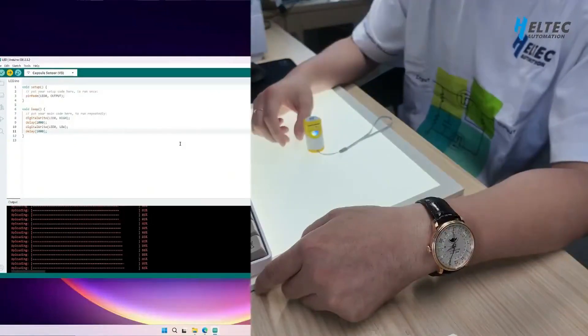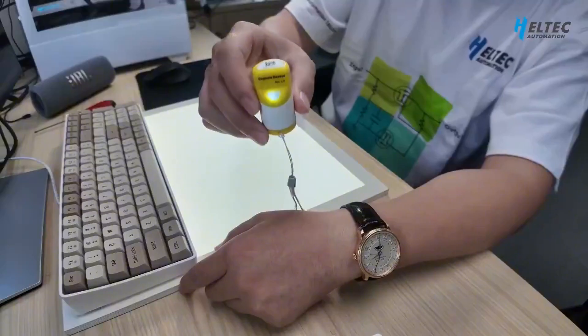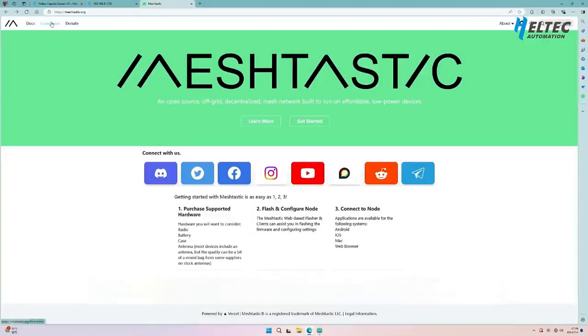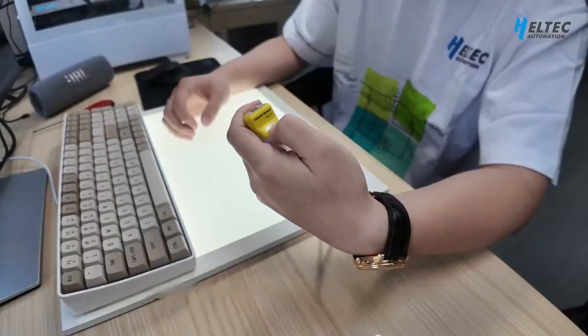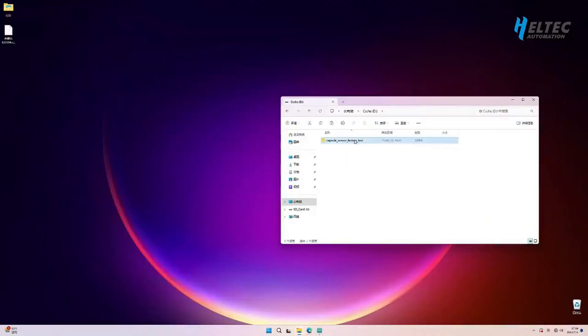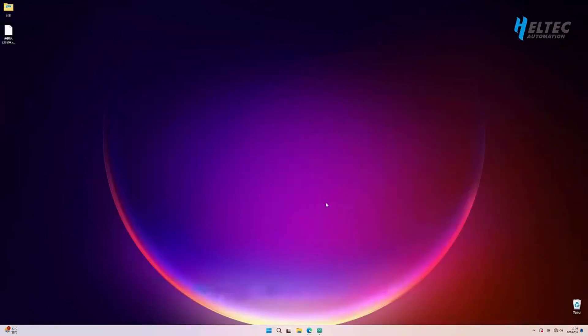Write a bit of code to make the LED blink in the development environment. Select the mode and you will find the wireless boot IP under ports. When uploading, you will need a password which is required by the IDE, but in reality we don't validate it.